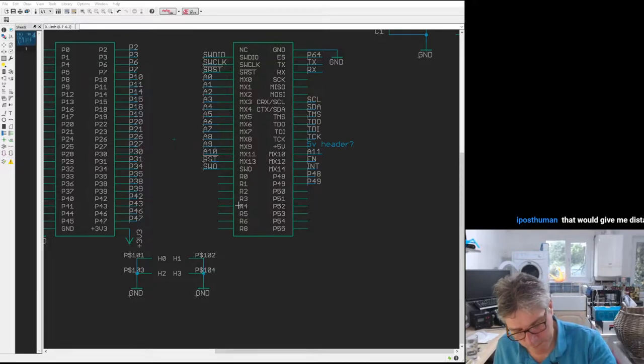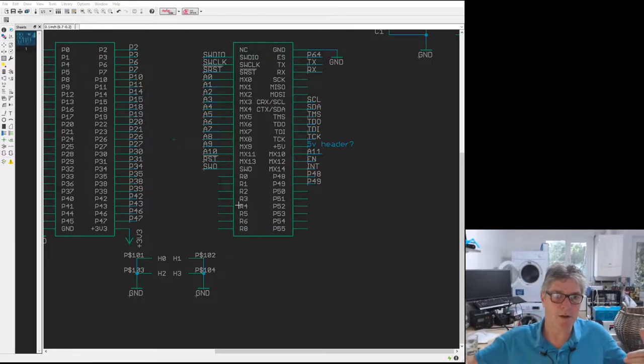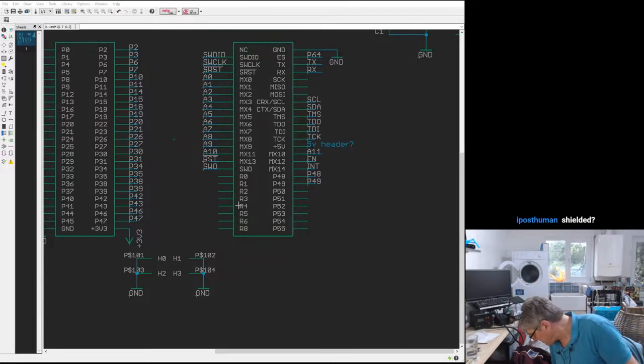It used to be used a lot for camera work, in astronomy and things like that. So if you had a camera away from the board, you'd run it over LVDS, over either one of those miniature high density D types, or that convert to like an IDC cable, or just through straight IDC ribbon cable connectors on each end. The other thing that you can do with that is, hold on, I wonder if I've got any here. You could do it right angled, so you could do something like. Just delve into some older parts here.